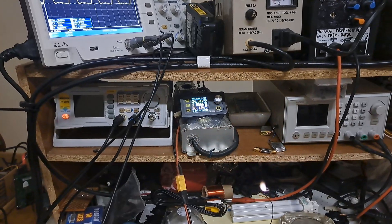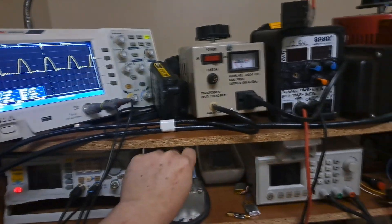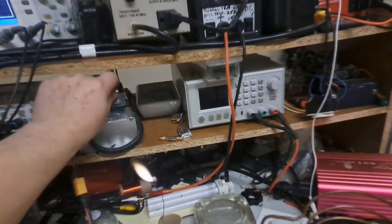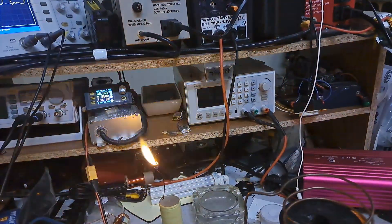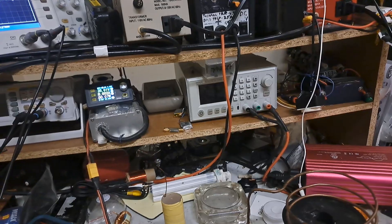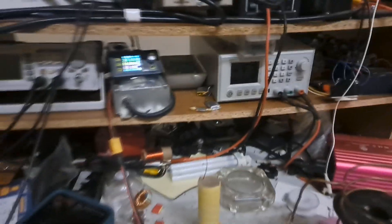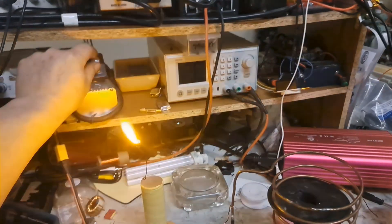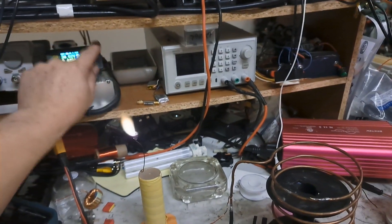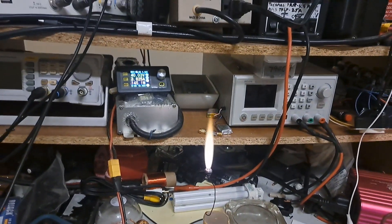With this one I'm going to back the gate back some. Still got a little bit of flame, and I'll crank the voltage up more. That's about 32 volts. I had a little bit of glass on there from before. Still backing the gate — brought it back a little too far. This is kind of the tuning process I do with some of these as far as bringing it up. Crank it back up again. We'll put that one at about 40 volts, pulling about 145 watts.